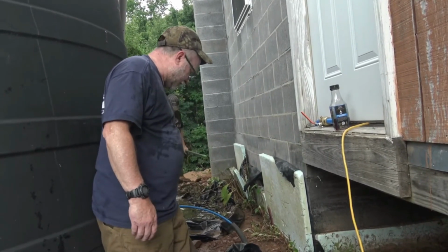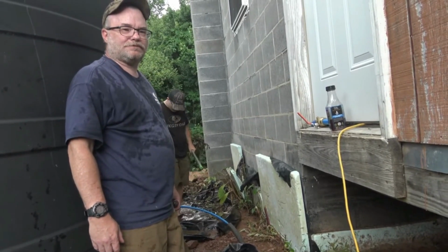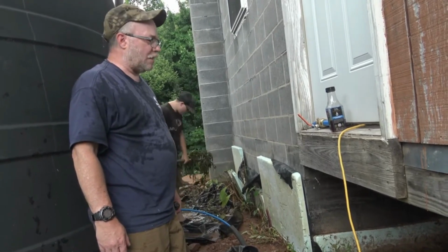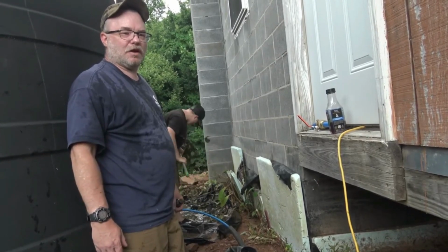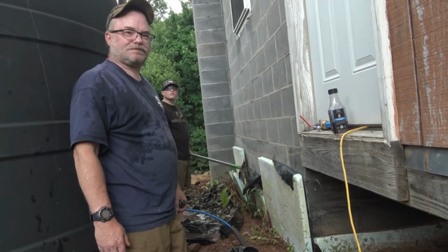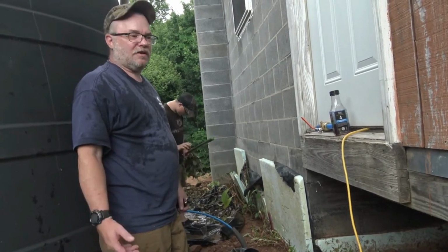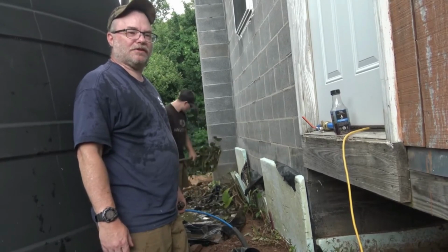It's got just a little bit of a drip, so obviously you can't use plumber's tape on that because it'll come right off with the rush of the water. Ideal situation, tank is empty, you can use plumber's tape and that's it. But it's a plastic fitting that it's going into, so it'll self-seal. I just have to tighten it up as tight as it'll go, and then the drips will stop. And even a small drip is not that big of a deal. You're talking thousands of gallons of water.